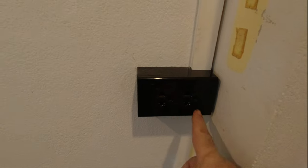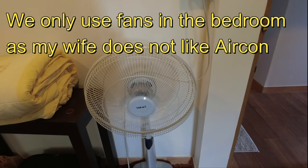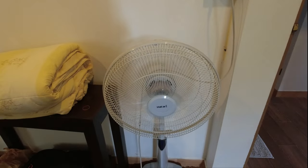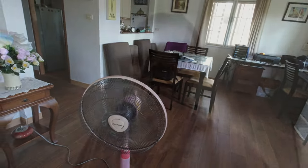I've run the cable into the bedroom and put black sockets on there - that denotes it comes from the solar panel. Plug it in and the fan is working. I've put the system in so let's whack it up to three - perfect. That's where I'll put it in for the emergency backup, so if the electric goes off we can have fans running. I've done the same in here with another black socket - plug it in and we can get the fan to work. When it's very very hot, you'll do anything to keep cool.